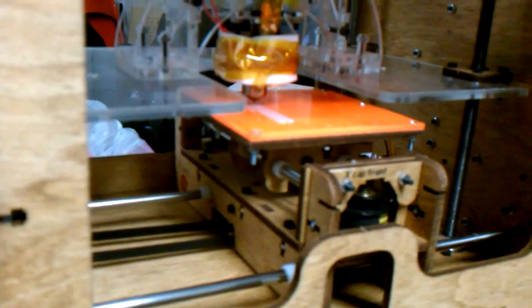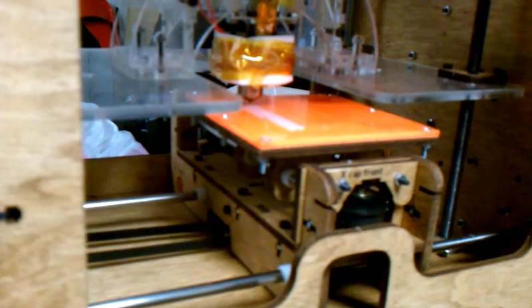So you're printing a raft. I forgot — when you print with a raft, you want to put the nozzle actually on this build surface. Because the first thing it does in the raft command is move the nozzle off a little bit, and then start doing its build.